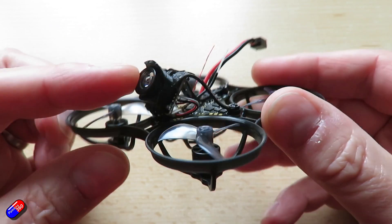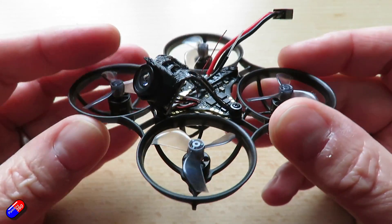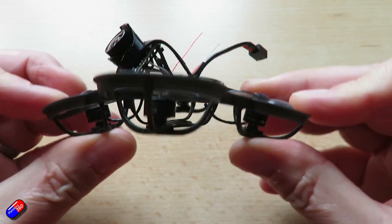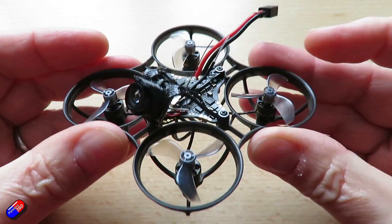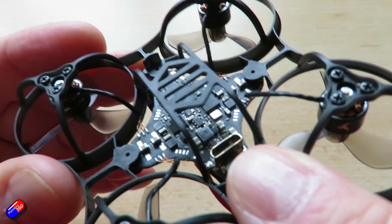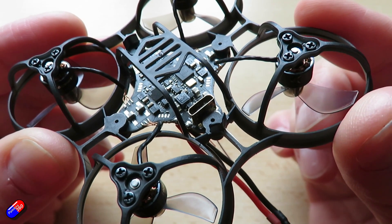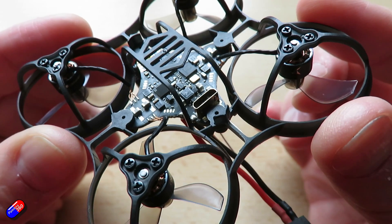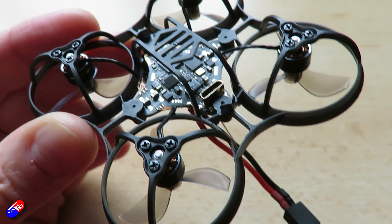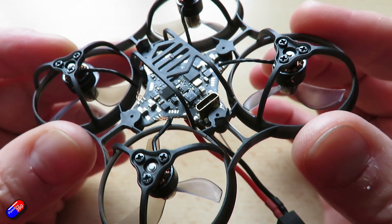Spare props are included in the box, which is a nice touch. I have heard of people getting jello on their cameras — I suspect it's because when you crash you'll eventually bend the props and possibly the frame, so just be careful of that. It does seem to be surviving the knocks I'm giving it without issue. I do like the fact that it has a USB port on the bottom. A lot of the flight controllers I've received recently for these kinds of machines have had some external little board and adapter cable, and when you need it you can never find it unless you're supremely organized.